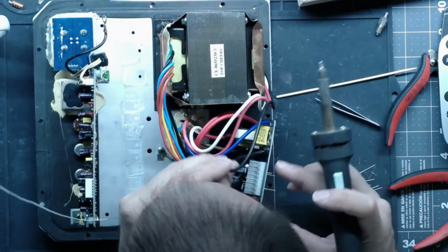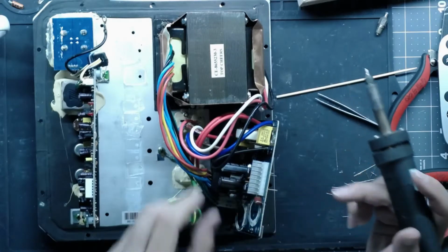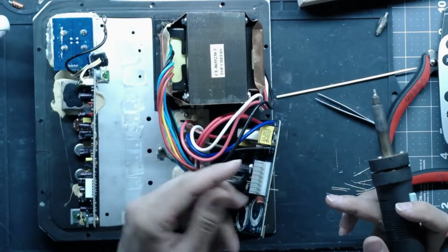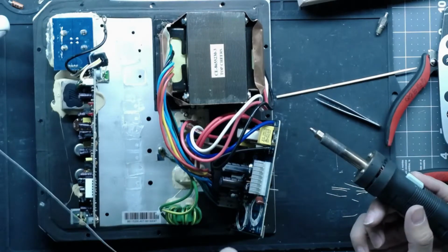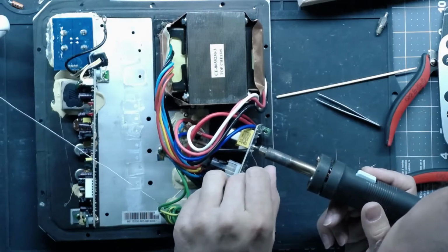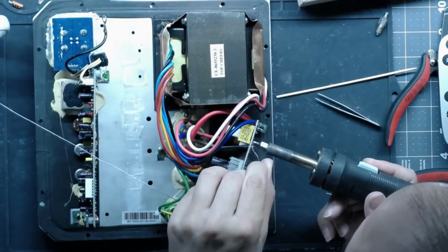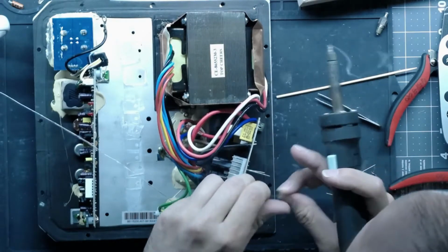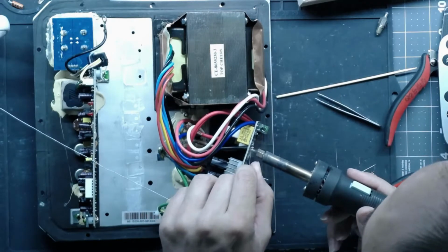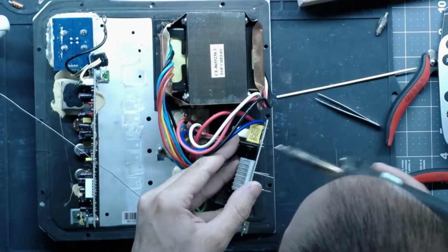It's still frustrating to find something like that. Like, where the heck's the quality control at? And why aren't these lines... Like, whenever you do a wire to a board, push that wire into the board. Not crazy to where you're melting the insulation and pushing it through the board, but get it on the board. You know, it provides its own strain relief if you melt it into the board. There's really no reason to leave a wire floating off the board. So, I mean, that's what I'm going to do. I'm going to get it in there and push it into the board.